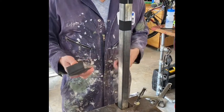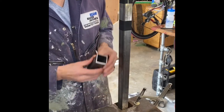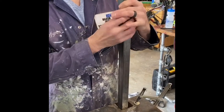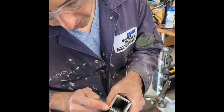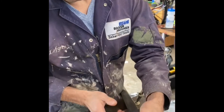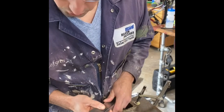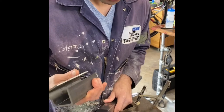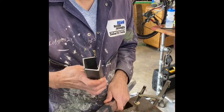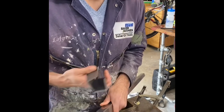Okay, now that we've trimmed down the edges so it fits, it's really nice. It overlaps a bit, so I can put a bead on this corner, another bead on this corner. It should really make it rigid as well. This wants to be pretty much the beefiest part of the kite buggy, since this takes the most torque about this point on the wraparound frame.